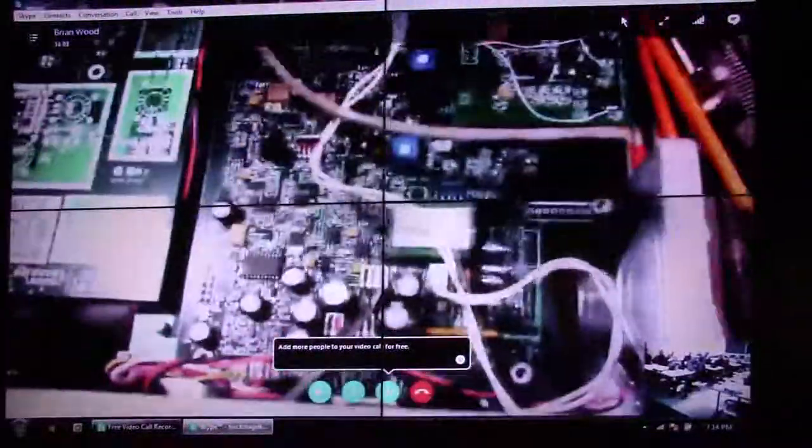Since this is a full duplex type of radio, you can transmit and receive at the same time on different bands and different modes. We have to have one oscillator for the receiver and one for the transmitter. In addition, there's a bunch of other oscillators for the other ones used on the receiver and the three on the transmitter. So that synthesizer board generates all of the oscillators used internally.